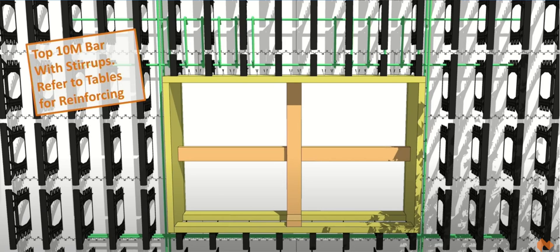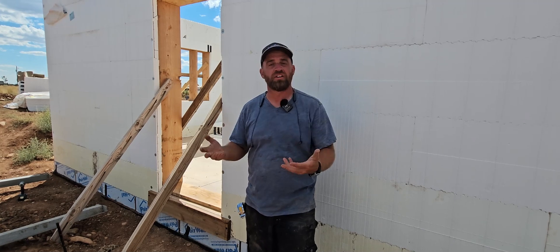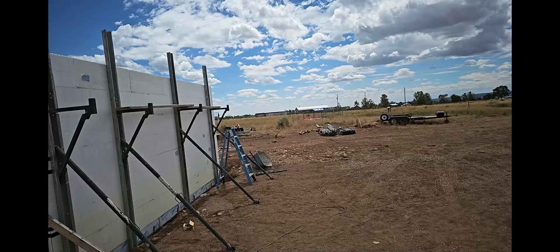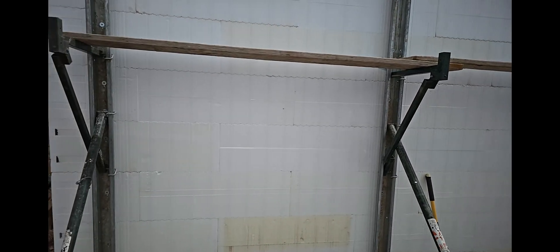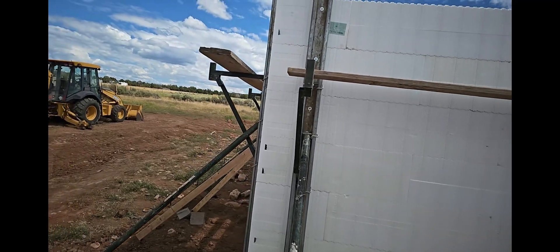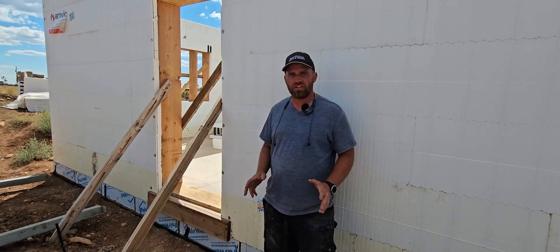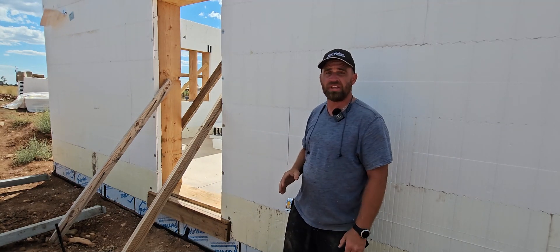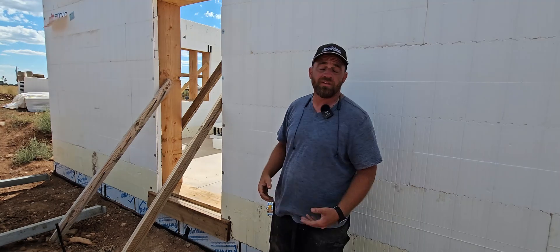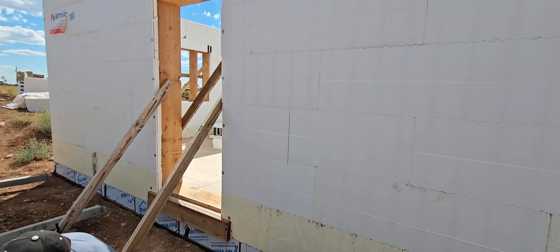When the concrete gets poured in here you can see how robust this section will be with the reinforcing steel. We've got all our ICF blocks up. Big problem I've been having: the wind is blowing the wall and it's making quite the sound, wanting to fall over. I had to put braces around the perimeter of the home. The braces are being rented from the same place I got my foam block. Every ICF manufacturer has studs built into the foam — they're plastic, said to have the same holding power as a 2x4. I'm going to screw this strong back onto that stud using a fairly powerful impact driver, being careful not to strip the plastic studs.